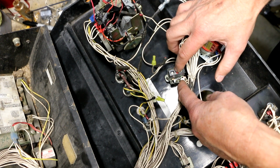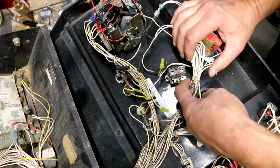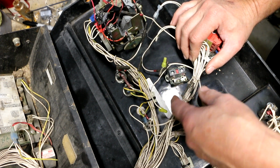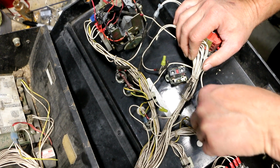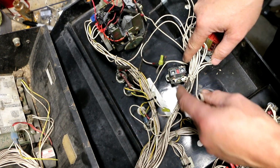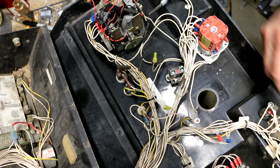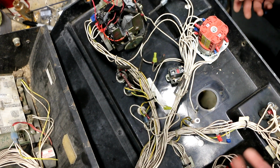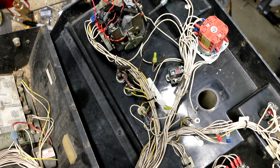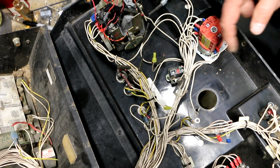And here's the funny thing. I just tested it. It's perfect. It works perfectly fine. So they disabled the e-stop for some reason. Who knows what. So what that means, though, is that that's probably what... Remember that wire I just pulled off that I said, hey, we don't need it? Well, why does it have 2 plugs? Well, probably because the other one of those 2 plugs was probably supposed to go over to this switch.